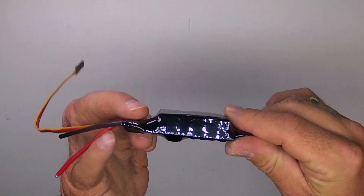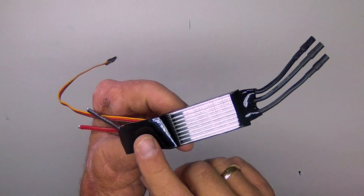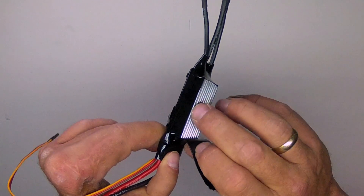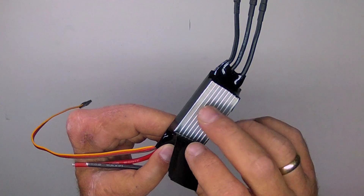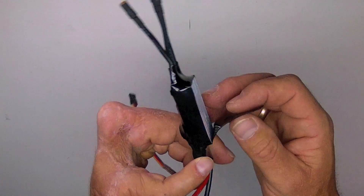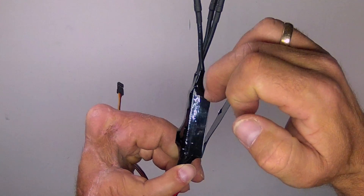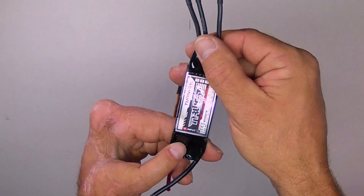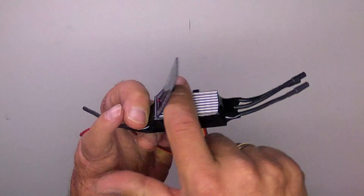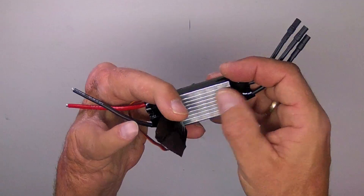Although it has heat shrink everywhere, I do recommend removing the upper part of the heat shrink to expose these very generous cooling fins and heat sink. When exposed to the airstream, this will keep the unit very cool. You'll notice that about half the thickness of this speed controller is comprised of that heat sink, and you can use that to protrude through the foam board body of your airframe, allowing the actual tips of the fins to be flush with the outside of the airplane, but still exposed to nice cooling air.